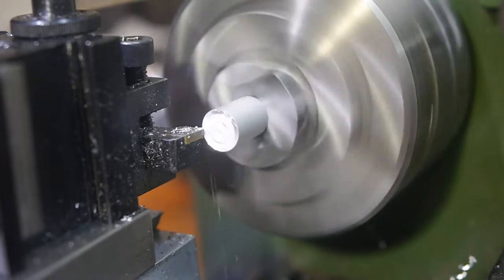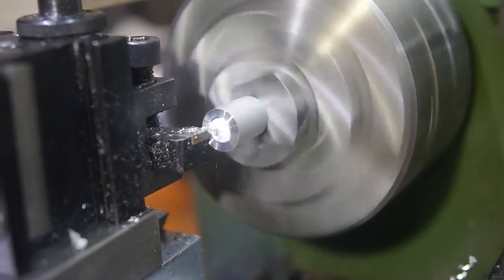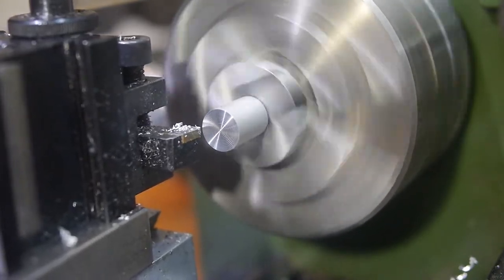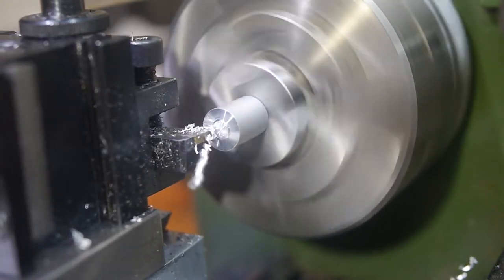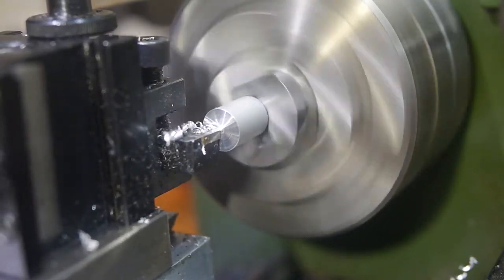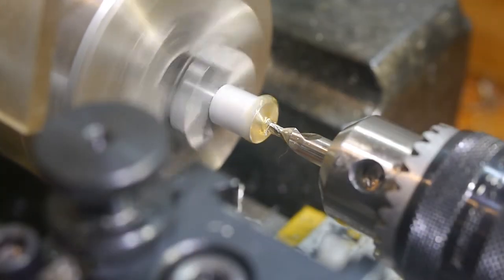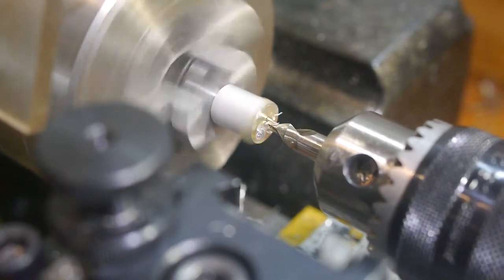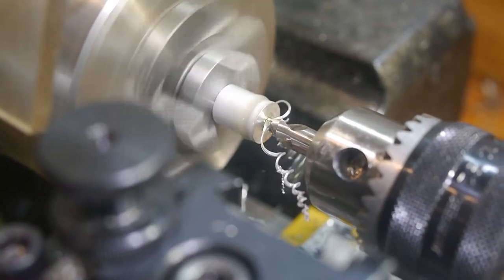The fixture I show being made here is a simple thread adapter with an 8mm thread on the outside and tapped with a 4mm thread at the center, so a regular M4 bolt can be used to prevent the plate from rotating around the clamping point at the center of rotation. It doesn't need significant vertical force as the drawbar provides plenty. Using aluminium made it really quick to make.